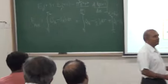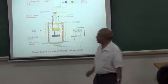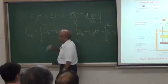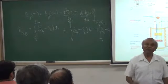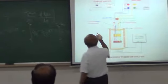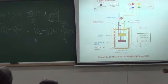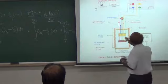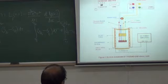Now, what is the beauty of this relationship? This one will hold good only if this is true, that is, the EMF is really the difference in physical coefficients. Had it been due to the nature of the contact, this would never have been valid. Therefore, this experiment I particularly like, and you are going to do this measurement. In position 3, I have internally made the connection in such a way that it measures between, say, chromel, and it could be anything, the chromel element.